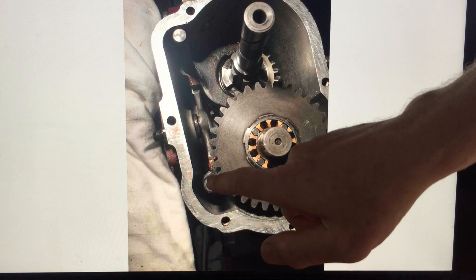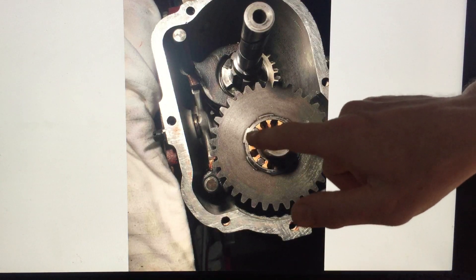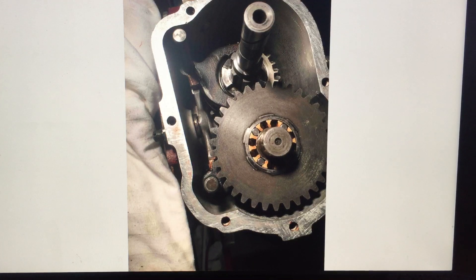I've put the rod in and now started fitting the bearings, putting them in in a star pattern. I should mention I packed the other side of this brass holder with grease to make sure it's all running well. This gearbox is filled with oil, but I tend to use grease — it tends to work a lot better. You can get very thick gearbox grease from your vintage motor supplier and I prefer that. If you can't get the grease, use the heaviest oil you can find — 50 or 60 weight — but then you'll have issues with sealing and transmission.